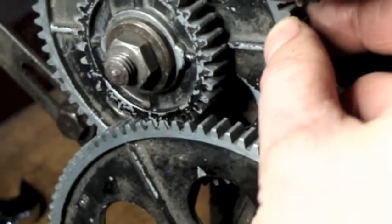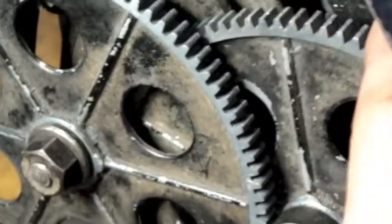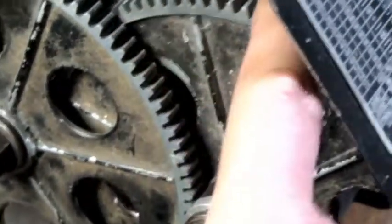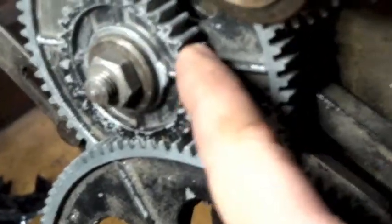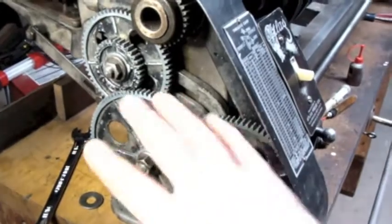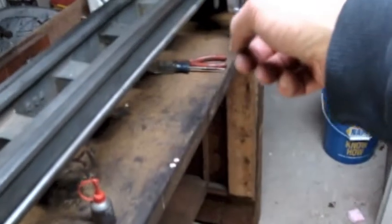I'm just really surprised at how loose these gears are, but maybe that's normal. It seems like I can't tighten these anymore and there's still just a lot of slop in there. Maybe that's by design — I can't really test it. I don't dare fire it up with the gears because right now I've got the half-nut engaged down there. That would be disastrous.